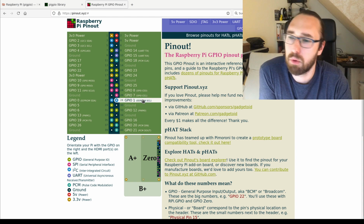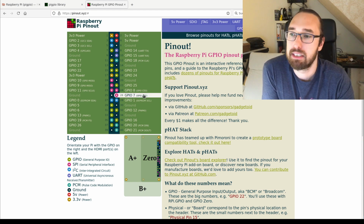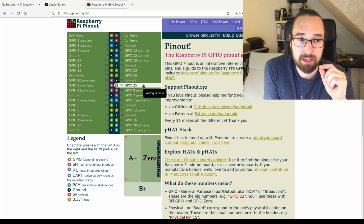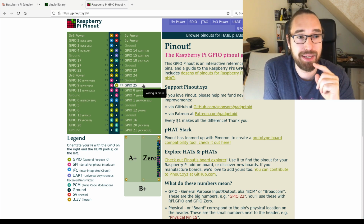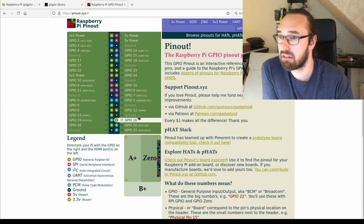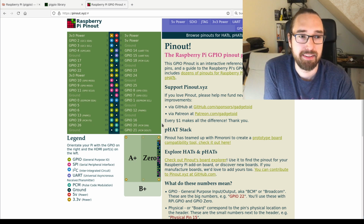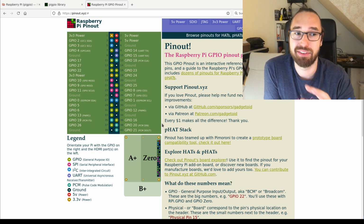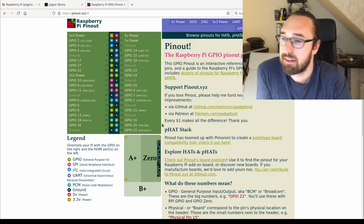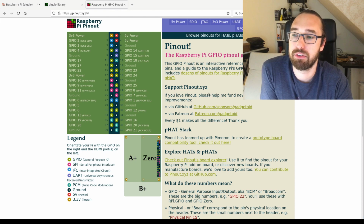Then there's more, but I guess those are the most important ones if you want to connect peripherals. And in MPF, we can actually use it to control servos directly. So you can use any GPIO on the Raspberry Pi for a servo signal. I don't know exactly how many, but 24 servos or even more. That's super awesome and super accurate because this can drive outputs at a super high resolution. It can also do super fast PWM and stuff like that. So that's something the Raspberry Pi can do.